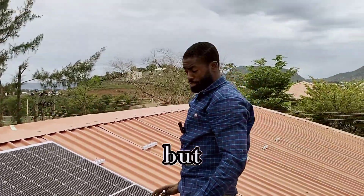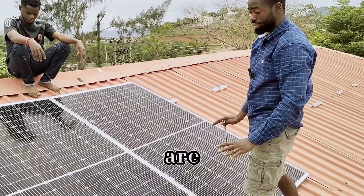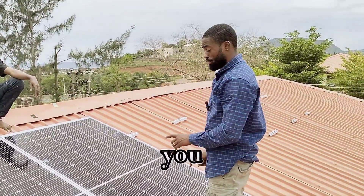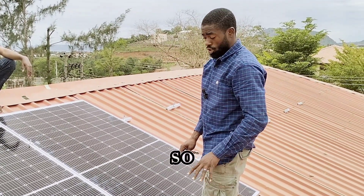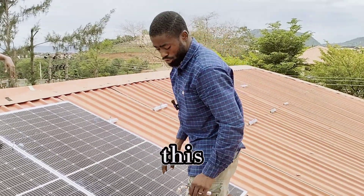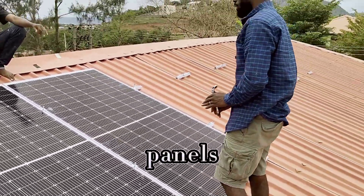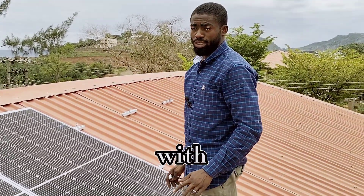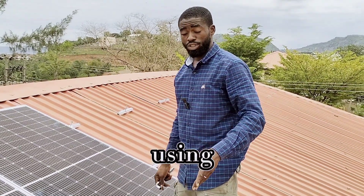Though we are not done tying it yet, you can see the panels are already steady — they are stationary and not moving. Don't forget to bolt everything very well, because if you don't, the panels will end up sliding down. I'll use a plier to support the bolt while I tie the nut. This is how you install your solar panels using aluminum profile — it's very easy. If you're a beginner, this is the best way instead of using bandy wires.